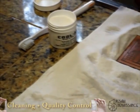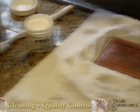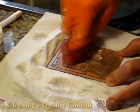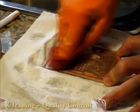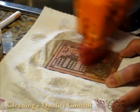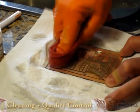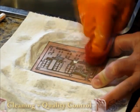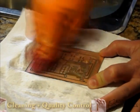What it does is it silver plates the exposed copper. The reason we want to do that is because copper will rapidly corrode and become unsolderable. So just to make things easier on us at soldering time.